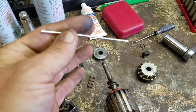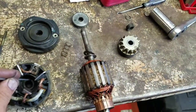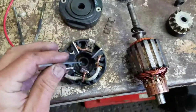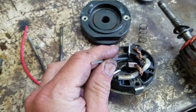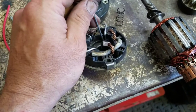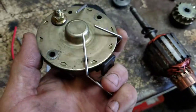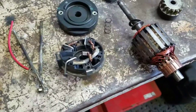A filler rod — a linear filler rod. What you need to do: there's a little hole inside there. When you take the brush and push it back in, there's a little hole slot down in there. All you do is when you put the brush back in, put your piece of filler rod in, bend it over, bend over the other side — holds it in place. That's all you do. Slip this back in, simple, easy peasy.